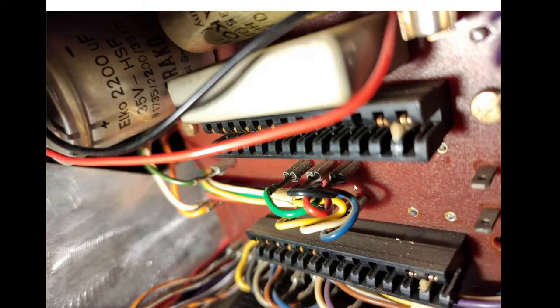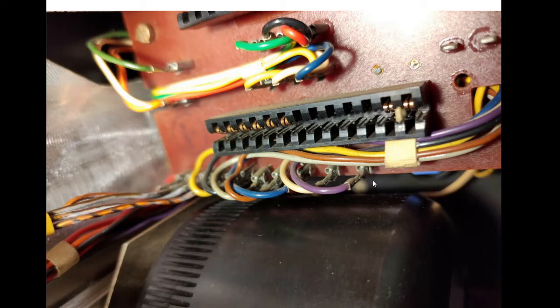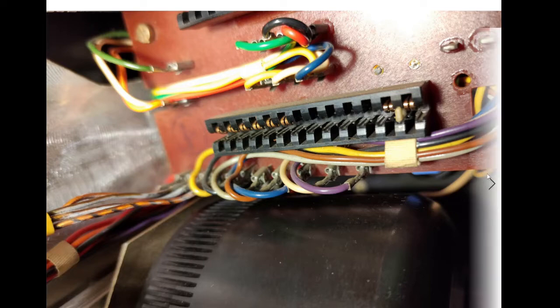These go to the speaker out plugs. These four cables go to the take-up motor. This other board is the spin control board. This is an old RIFA capacitor that I have replaced — everybody replaces this as a first job — and there is a small rectifier. I have serviced this board earlier, so I have already replaced some capacitors, but I did not replace this bridge rectifier. Some users say we should replace this rectifier regardless, because sometimes it is problematic in a way you can't see, so I replaced it.